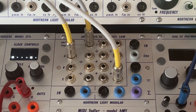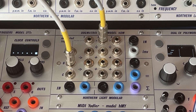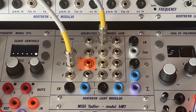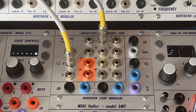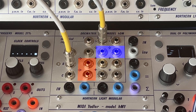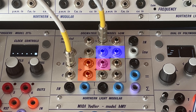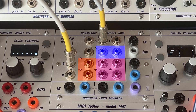Let's move our signals to inputs 2 and input B. This totally changes the nature of the outputs. The first intersection is now empty, as expected. The output right next to the B input carries the signal from B, and also the one below, called C1, has a copy of the B signal, as C is being fed by B through normalization. In the A row above, we see the same — A2 is a direct copy and A3 is the downstream one. So our two inputs generated two copies each. But at B2, the intersection of our signals, we get the mixed signal again — and not only here. Because the normaled copies also meet at C2, B3, and C3, so we get four mixed signals now.